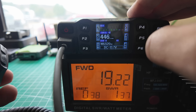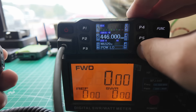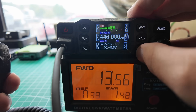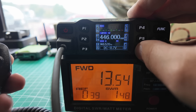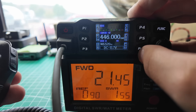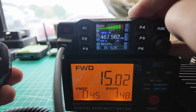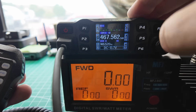This one's already been taken care of on frequency. Let's do power low — that's 4 watts out on low. Mid: 13.56. And I can hear my voice, so we're doing two tests at once. Power high: 21. So can we do GMRS stuff? Yep, it's even got the step setup right in there. 15 watts on GMRS. Don't do GMRS on these things — you're not supposed to do that.